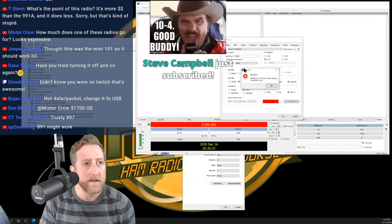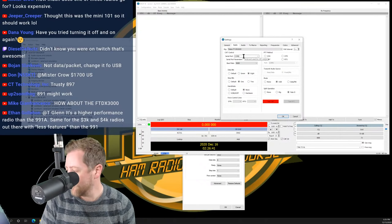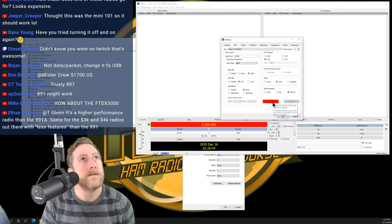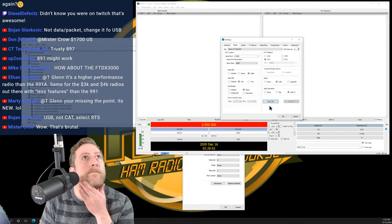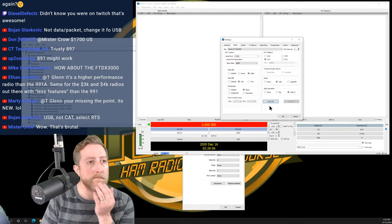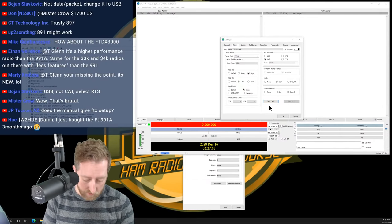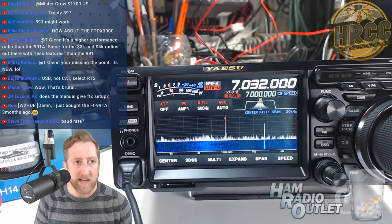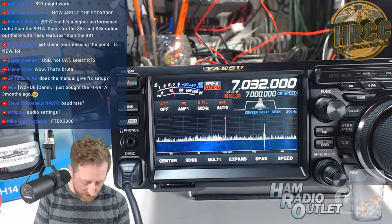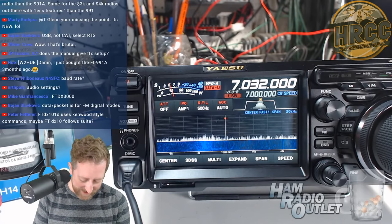891? I don't think so. Change. No data packet. Make it USB. We can do that. It's okay. The manual's not going to tell you, I mean, it might, but most likely not. And it's okay. Like I said, I'm winging it on this, day one when this thing came out, right? The baud rates are the same. I've got it matched already. It's no big deal. It will work. Don't worry. It will happen, I promise.